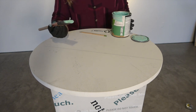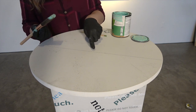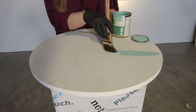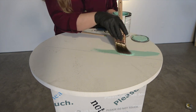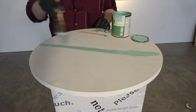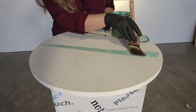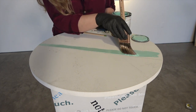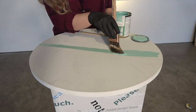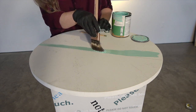When we're talking about cutting in and painting along a straight line, I've got my pencil line marked here. You want to start by pushing paint towards it — I think of this as flirting with the line, but you're not quite making your way all the way to it until your second pass. I'm using the angle of my brush really specifically, catching the extra paint that collects along this line until I've got enough on my bristles to control it and pull it all the way across.